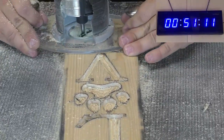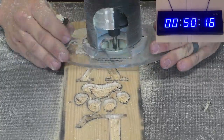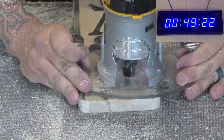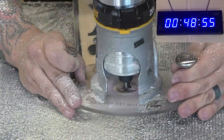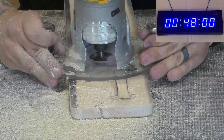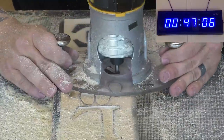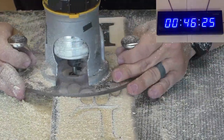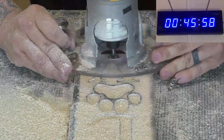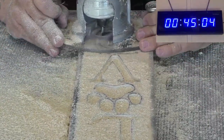For the first sign I actually used the 60-degree bit, but that didn't work quite as well — it didn't take out as much material as the 90-degree. Dad suggested I switch to the 90-degree bit, and that actually worked really, really well. The 60-degree is fine, there's nothing wrong with it, but as you can see I was racing the clock, so my biggest issue was getting these done as fast as possible, making them look good, and getting them ready to sell.